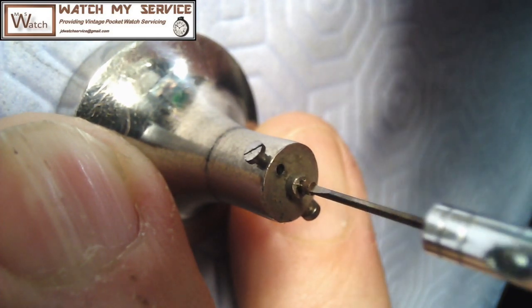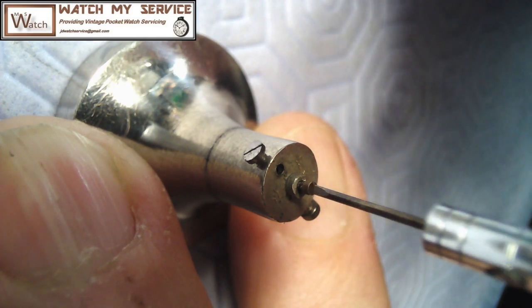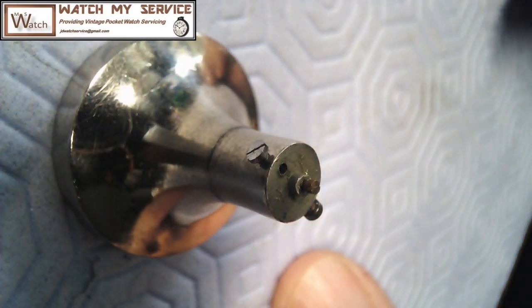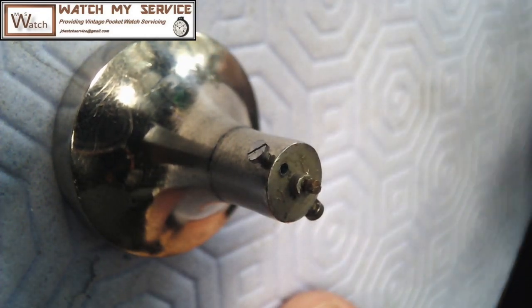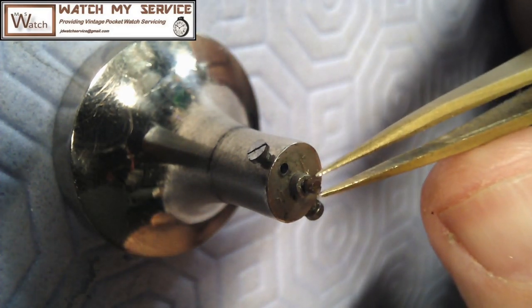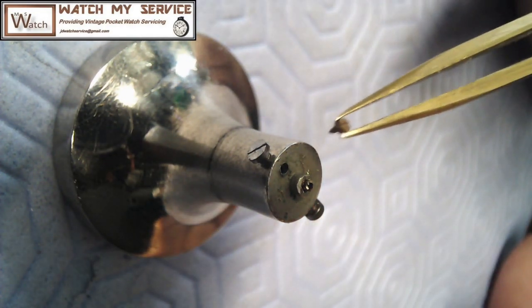I'm not sure how much material to remove here, but if I remove too much material I've got to put in a counterweight. The thing sort of dropped pretty far so I'll give it quite a few turns. My recommendation is to remove a little bit of material, put it back in, poise it again, then remove more - because if you remove too much you can't put material back, that's the bottom line. When I pull this out you'll see there are little flakes of metal left over on the bottom from the material removed.